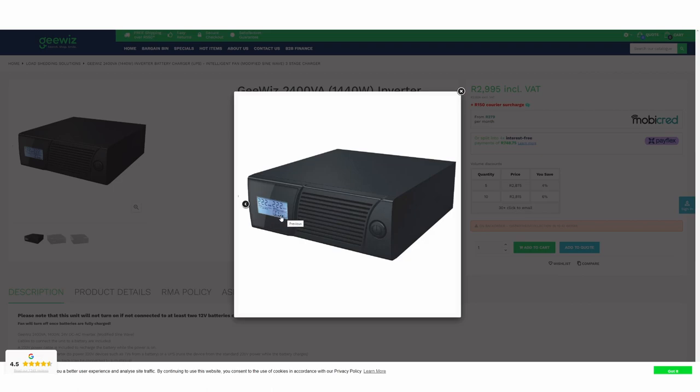You can also buy the leads in order to connect them up straight onto the batteries. It is recommended that you fuse them, that you put fuses on the batteries, the positive terminal straight to the inverter. And some complete kits will come with a breaker built into it, a circuit breaker, in order to switch off power going in and going out, if it does trip, that type of thing.